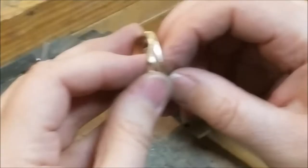When you can use a bigger tool, you'll take away more metal, so now let's try the sanding disc. You can come in on this whole curve on the outside. I put the sanding disc toward the shaft, not out here, because you have way more control that way. You can come in and feather this in, but you can make terrible divots with this device, so keep it moving, keep it feathering — always. That is one of my all-time go-to tools; I love the sanding disc. But you have to use it wisely — keep long, moving, overlapping strokes. Notice how she's bracing and pulling, moving the ring around.